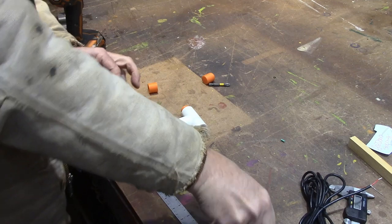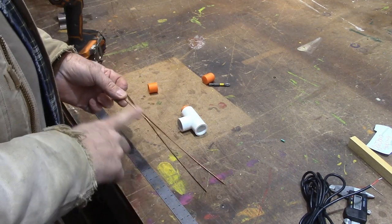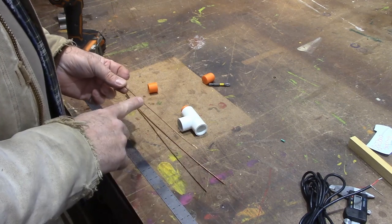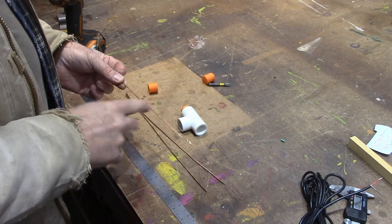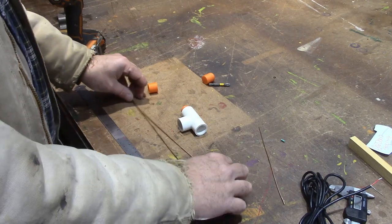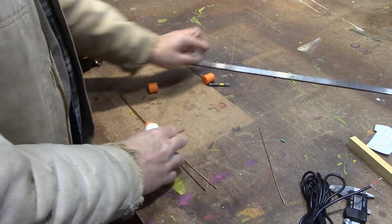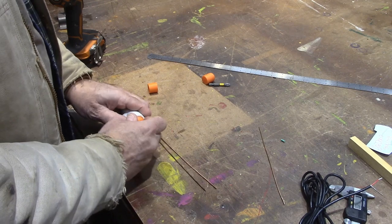This wire — you could use aluminum rod, brass rod, or copper rod. I'm using 12-gauge copper ground wire like what comes out of Romex — that's exactly where this came from. I've also got a PVC tube here, and I 3D printed some pieces to go inside it to hold the antenna elements.